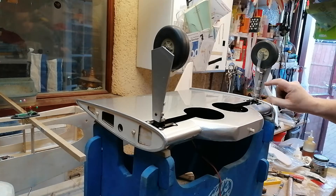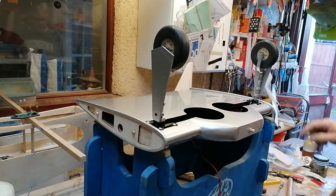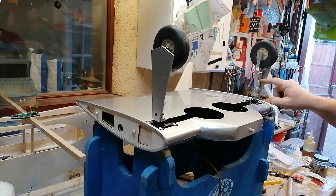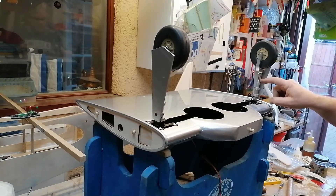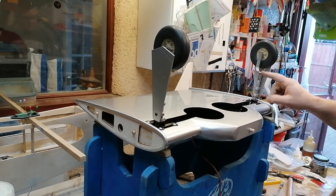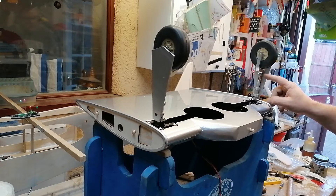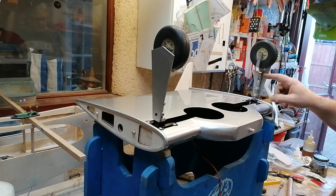We used the existing bodies of a Seagull Focke-Wulf, modified them and re-sleeved them. Stainless 316 main oleo pin, stainless running on alloy, light oil in there. Aluminium shape — that body goes into a bore in there, which is pinned. It's a press fit.